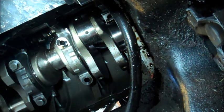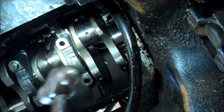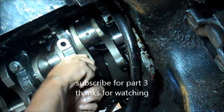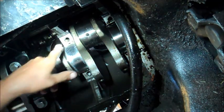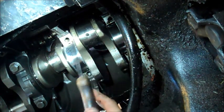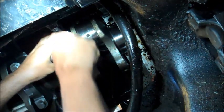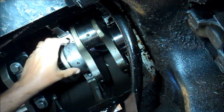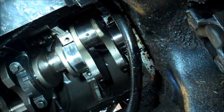While I'm at it I'll show you how to pull these old bearings out. I've removed my bolts. I just take a hammer and tap them a little bit to loosen them up — sometimes you can take a bar and wiggle them. These ones come out pretty easy. Pull that down — that's your main bearing yoke. Now to get the bearing out, they make a special tool but I just use an old putty knife, get in there and slide right up around. Get them started — they usually come out pretty good. Get it halfway around and drop them down. Simple as that.